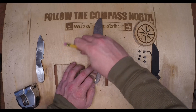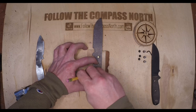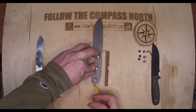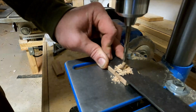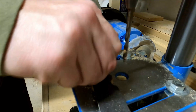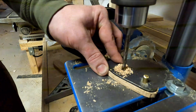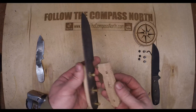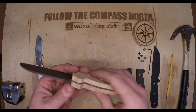I apologize for the change in backgrounds — you'll see a couple of different work surfaces being used because this video is spread out over the course of several days while I was waiting for the kiln to come in. The trick with drilling your handle scales is to have the handle scales slightly larger than the blank so you sand it back to the metal, and each time you drill a hole throw the pin in immediately so you don't lose that location. Do this for all three pins and they'll line up absolutely perfectly, then you can drill through to the other side and have both sides match up.